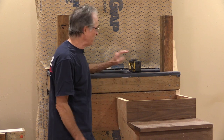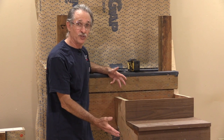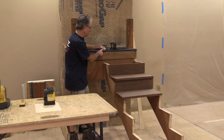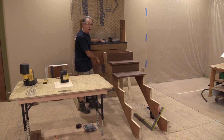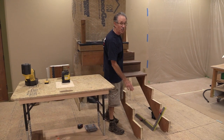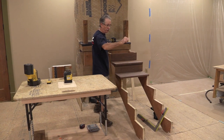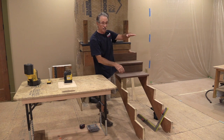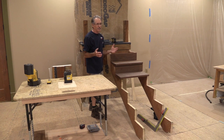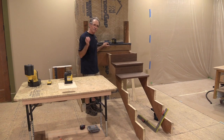Before I shoot that video, I want to talk about lasers. A laser is the first tool I reach for when I'm laying out stair stringers because you can't measure the drop directly from the deck straight down. You've got to measure the drop for the stringer from the top of the deck all the way out to where the stringers are going to land. In order to do that, you can hold a level up here in the air and pull a tape down to the floor and try to hold that level perfectly level, which is kind of a drag — it's not precise. What if the stairs are running out 10 feet?